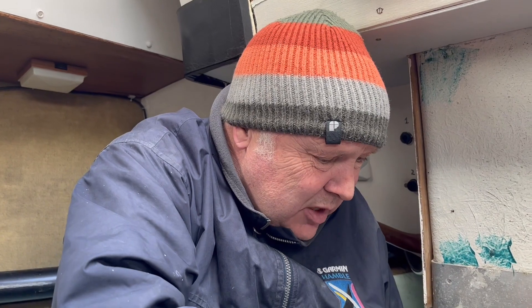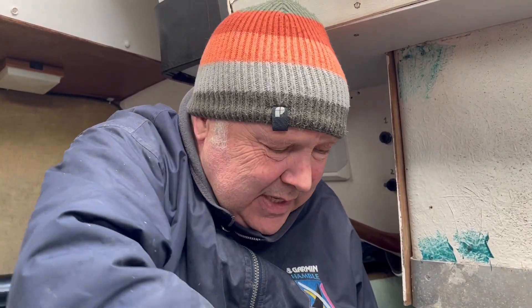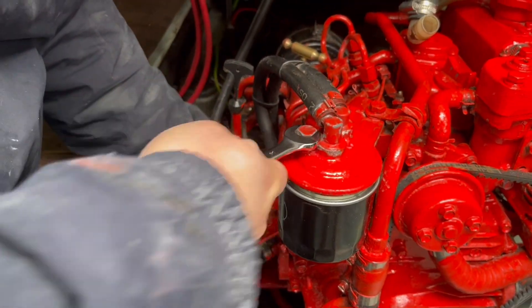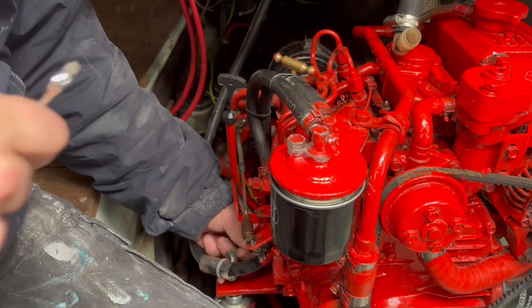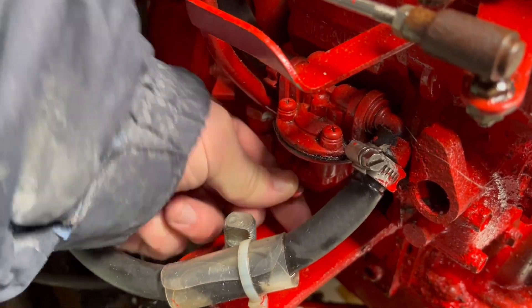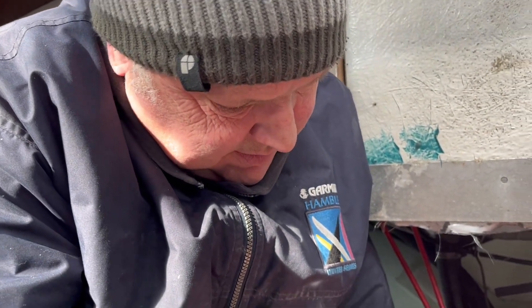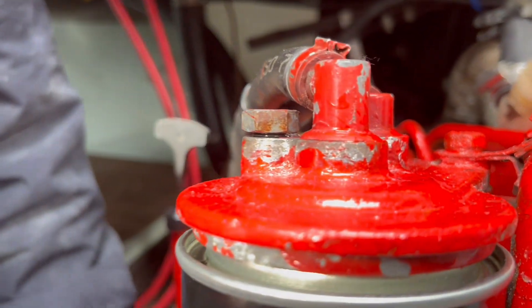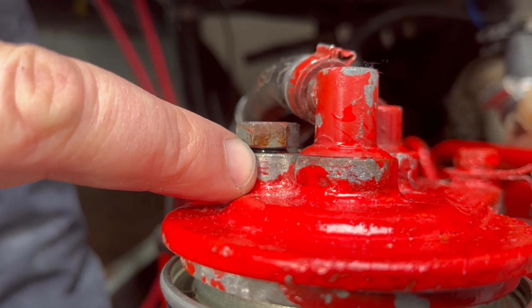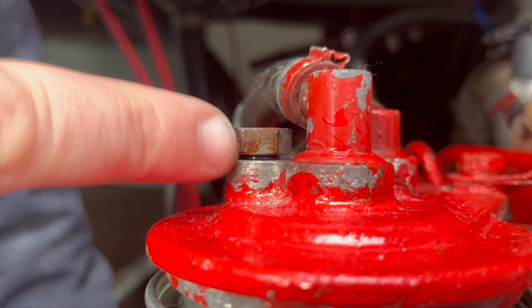So, as I've been reliably informed, we're going to crack open this little thing and then pump this little thing here until we get some stuff coming through that. We'll see how we go. It doesn't look like there's much progress after about five minutes of pumping this little pumper. But what we're looking for is these little bubbles coming out of here very, very slowly. And when we get a better flow, we're just going to nip this up.